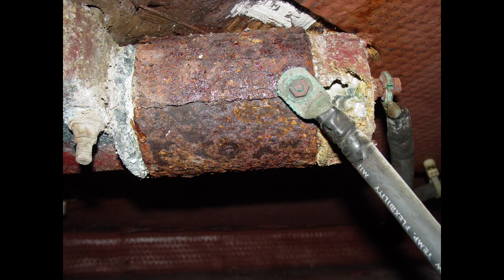Address any corrosion immediately to prevent it from worsening. Inspect your foredeck switches for damage and proper operation. Ensure the hinged covers are in place to prevent accidental operation and that the covers themselves operate easily and have a good seal when closed. Check the rubber diaphragms for cracks, tears, or deterioration — you can spray them regularly with a UV shield such as 303 Aerospace Protectant to extend their service life. It's also a good idea to keep the windlass covered when not in use to protect it from salt corrosion and UV exposure. Finally, use the windlass regularly to keep all internal gears lubricated. Grease and lube oil tend to settle at the bottom of the gearbox, resulting in dry sections of gears prone to rust. If at the dock or on a mooring, crank the windlass over a few turns every couple of weeks.